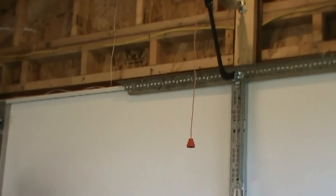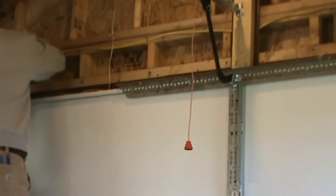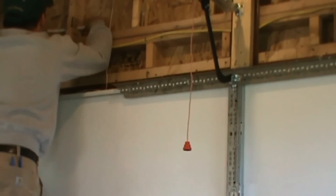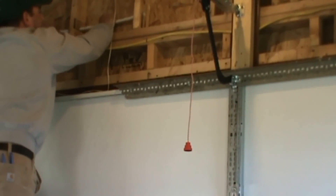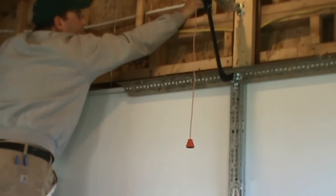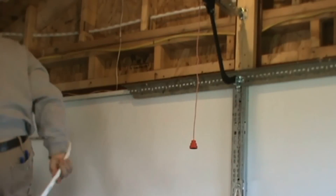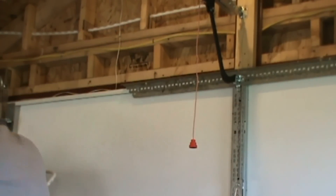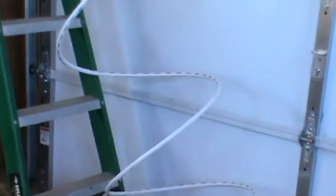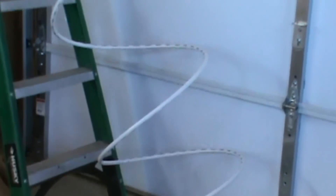Now what I'm trying to do is pull this PEX through these holes. The nice thing about PEX is you can make long sweeping corners and you don't need to use elbows if you make long sweeping turns. It's somewhat rigid but it's plastic so it slides through these holes fairly easily. We're just going to continue running this spool through these studs. This is just half-inch PEX and it comes on a spool — I think 100 foot might be like 30 bucks.